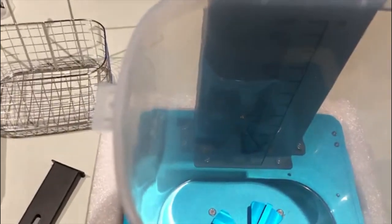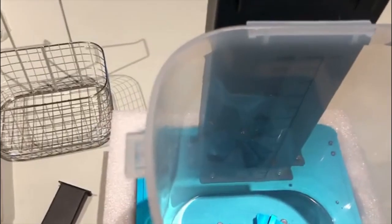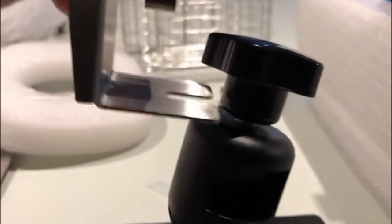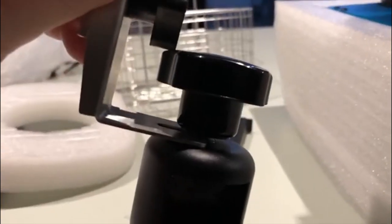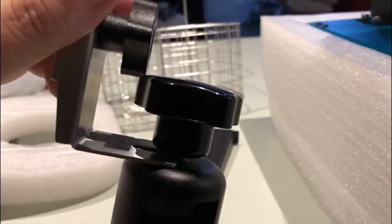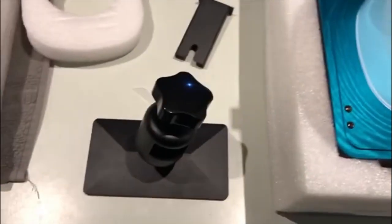Again, the slot here is too narrow if you want to put the Elegoo Mars bolt through it. Even if you widen that slot, you've got another problem — those knobs are going to hit, so you're still a little bit stuck. There may be enough clearance but I don't think there is. You may have to change the knob, but these are early observations for Elegoo Mars users.